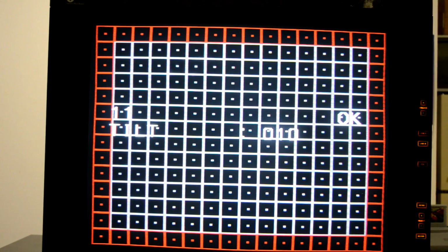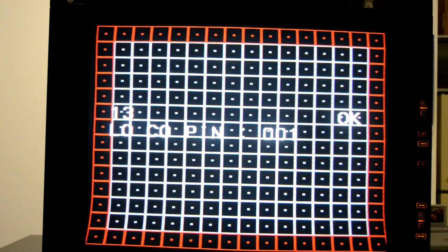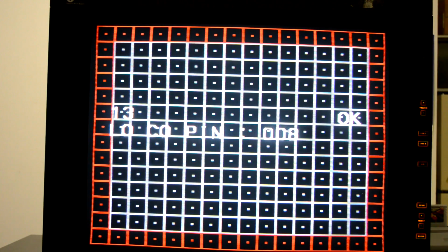Here's a little bit more on the tilt control. And as we continue to work through these, we'll have upper pin cushion settings where we can do the same adjustments for upper and lower pins that we were doing on the entire pin amp. So if one side looks like either the top or bottom looks like it needs a little bit more adjustment, you can use this to adjust just the top and just the bottom, the lower and upper pin cushion settings.